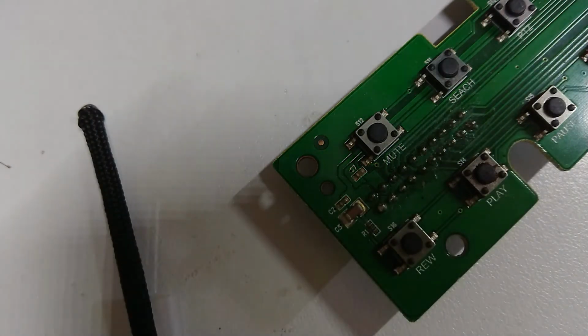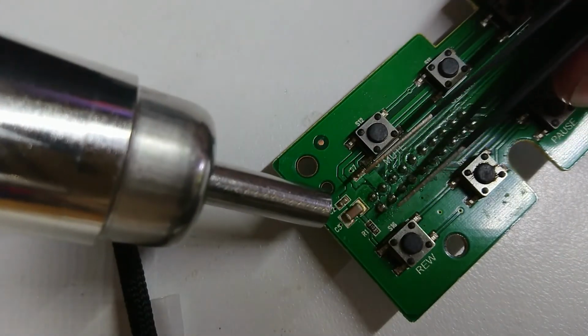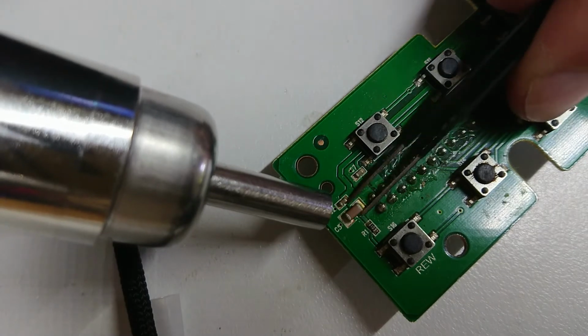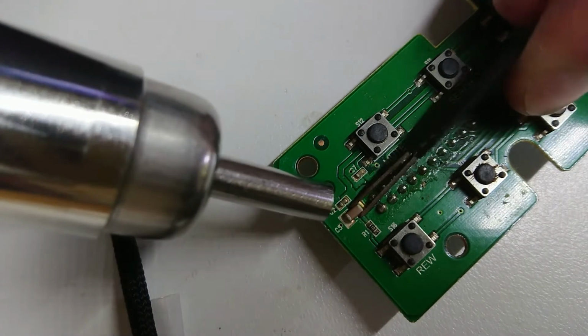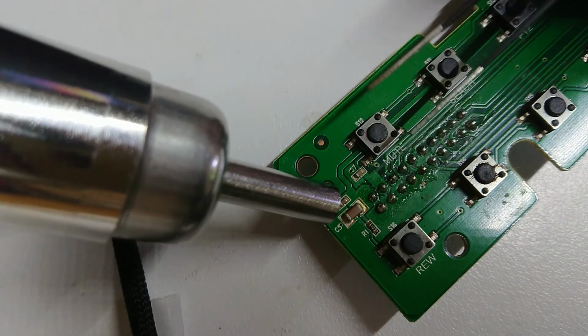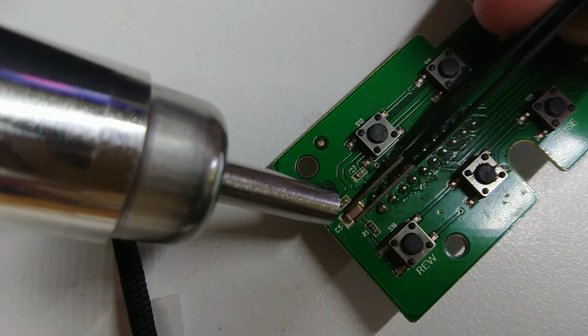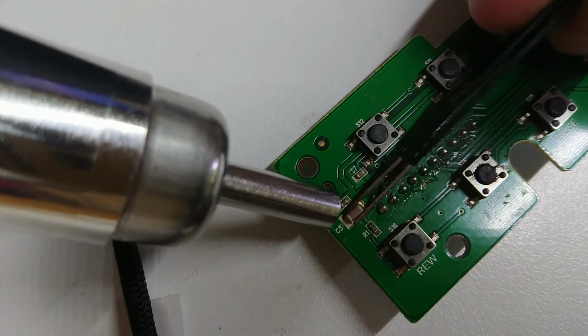Let's bump this up a bit. Off memory, I think lead-free solder only really needs a couple of 100 degrees. Not a great deal, I think, or I presume we're dealing in Celsius here. Let's see. Felt a bit soft and movable there, but let's see how we go. Got the air at sort of a medium flow, trying to start at the mid-ranges.